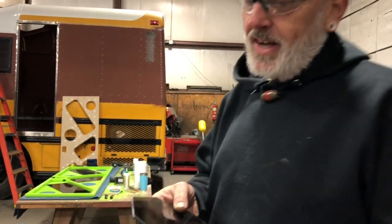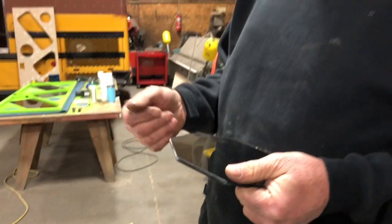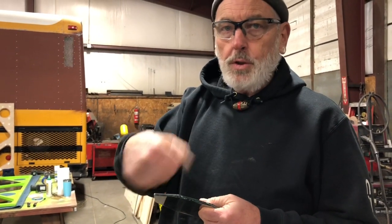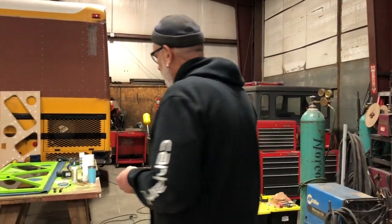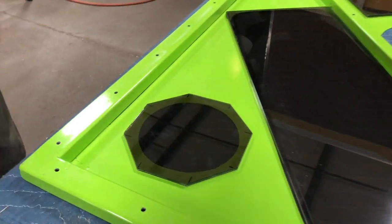That's what they call a dry seam in the glass business. These windows when I took them out were already dry seamed, so they had the sharp taken off the edges. If you stay too long on one of those points and push too hard it'll get hot and crack the glass. But now this will be much more durable when we install it - that's ready to go in. Thanks for watching, I hope it's helpful.